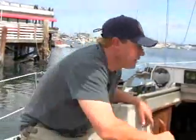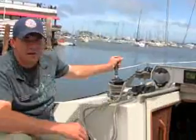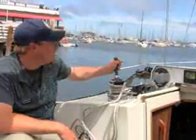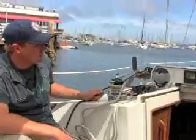Loosen up your mainsheet and crank it up the rest of the way. The mainsheet is on the starboard side. Finish off with the winch. The gooseneck is fixed and doesn't go up. After you finish raising the main, tighten the sheet. The traveler is fully functional.